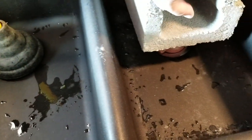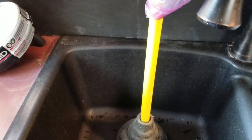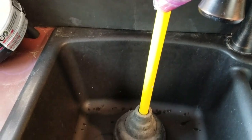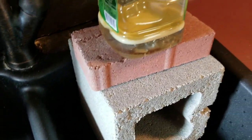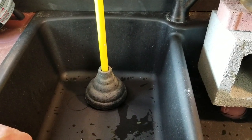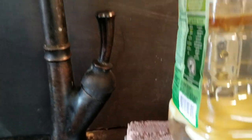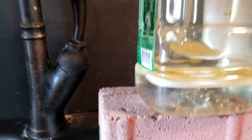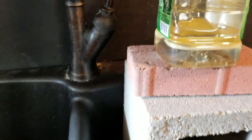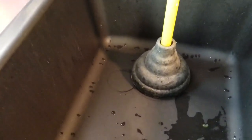Take your plunger with the two bricks on there holding that little knob down with the cup. That'll let you plunge this down, and now instead of the water flowing over to the other sink, it's going to go down. You might have to pump this thing 30, 40 times, because each time you're only pushing maybe a cup of water down toward that clog. I wrestled with this thing for three, four days. Got nowhere — snaked it, poured every kind of chemical known to man, spent probably 30 bucks. But pretty soon, every time you're pumping, you're pushing more of that hot water down to that clog.